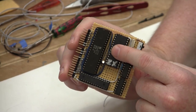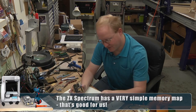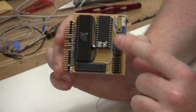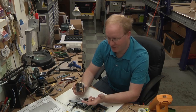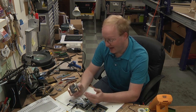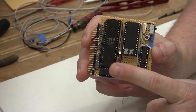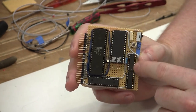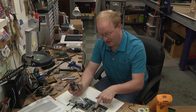The ROM sits at the bottom 16K of memory, and the RAM sits at the top 32K of memory, which means there's a second 16K bank reserved for the video RAM. What these chips do is take the address signals off the Z80 and enable either the ROM or the RAM chip. Each ROM and RAM chip have output enable and chip enable lines, and by connecting those in a certain way you can control whether the chip is active or in tri-state. So when it's reading the ROM, the RAM is disabled, and vice versa. The video RAM is controlled by the ULA chip.